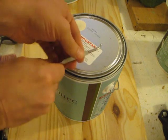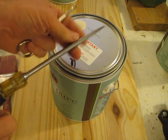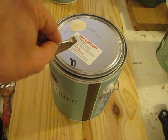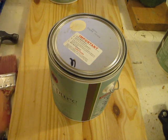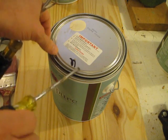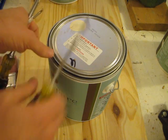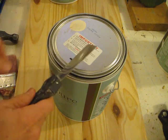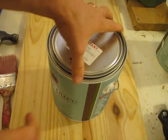If you don't have or can't find your paint can opener, you can also use a larger screwdriver. This one is a good size because it's wider than a typical paint can opener, and you can get under the lip and do very much the same thing. I would not recommend using a smaller screwdriver because that will put too much pressure on the rim and you'll get more deformation. You could also use a nice stiff putty knife to do the same thing.